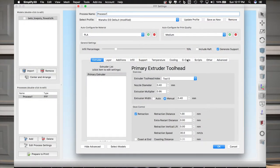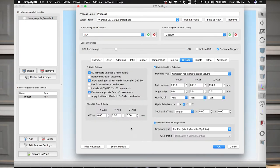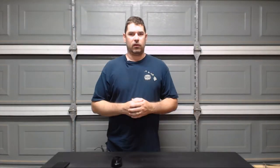What you can do is, once you've done it a few times, you can learn the deviation between leveling with a cold plate and a hot plate. For example, on my DI3 I've learned that I typically have a .1mm deviation between cold and hot, and most firmwares or even in the slicers themselves allow you to make offset adjustments so that you can either raise or lower your starting point beyond what the firmware thinks is zero where the end stop is hitting. So it's worth factoring that in and giving that a look as you do your bed leveling.